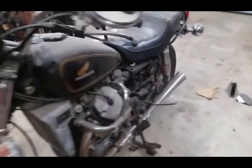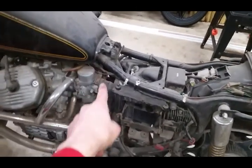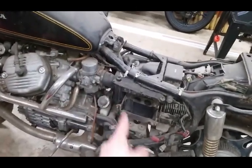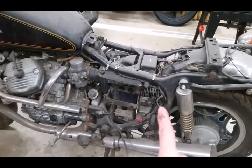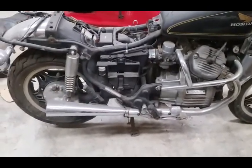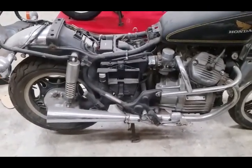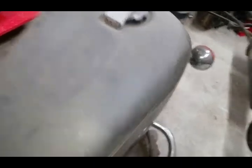What I end up doing to these is I'll take this ugly seat off and throw that to the side. I take and cut out this section of frame — I'm cutting the frame off right here so this whole loop comes out. I tear off the rear shocks, all the electronics have to be relocated, and the wiring harness has to be cut dramatically.